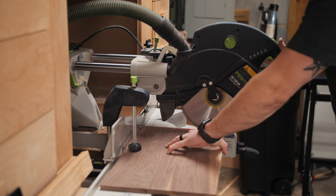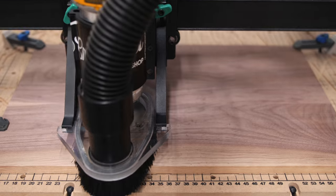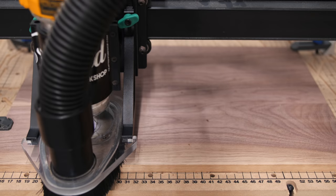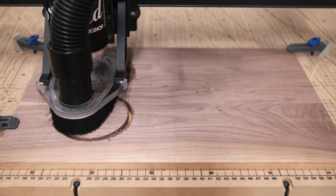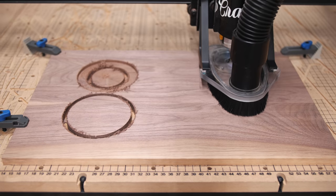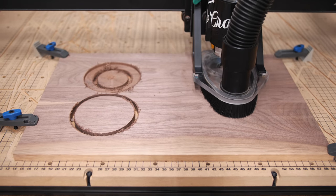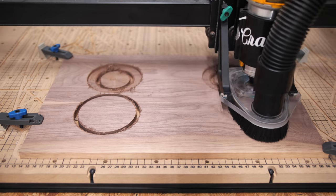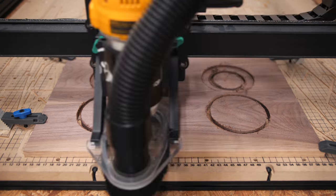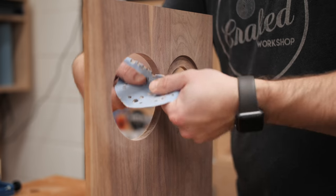With the frame of the boombox glued up, I cut the front and back panels to final size based on the frame dimensions over the miter saw. Next I needed to get the holes for the speakers cut into the front panel. The speaker kit I used was the C-Note kit from Parts Express — it comes with MDF enclosures, and you could use a flush trim bit with those enclosures as templates, but I let the X-Carve do the work. I modeled a quick design in Easel, Inventable's free CAM software, did a test cut on half-inch plywood to verify fit, then made the final cut on the walnut panel. The whole operation took about 13 minutes with a quarter-inch bit. After the X-Carve finished, I cut the tabs holding the leftover pieces and cleaned everything up with a spokeshave and sandpaper.